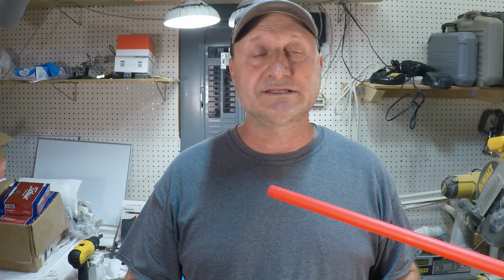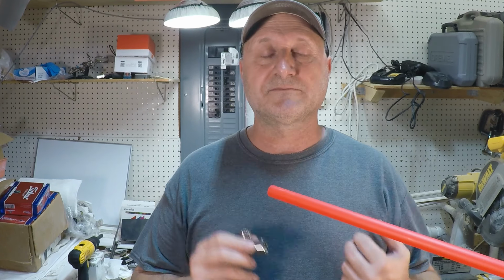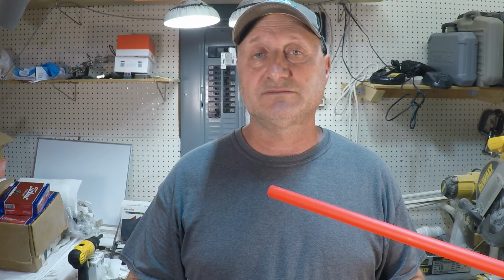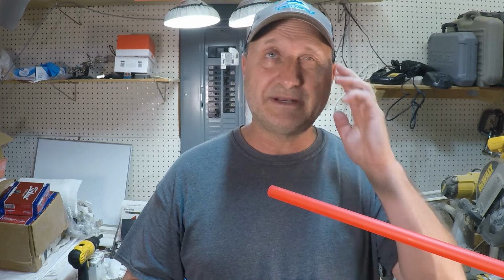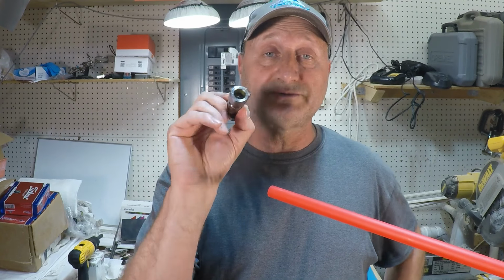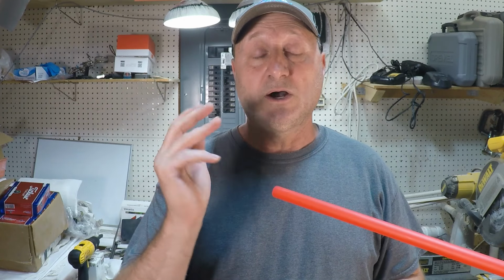And again, it doesn't matter that you installed it properly, but that expansion and contraction without the inner sleeve will create a potential serious and hazardous situation. And water is, in some instances, just as bad as fire. Well, maybe not just as bad. I say fire is worse. Number two is water. And I prefer even the PEX type push-in fittings than I do compression fittings, because if you install PEX properly, it will be fine. So that's the story, and that's why you should pay attention and not buy a compression fitting if you're using it on PEX pipe. I hope this was helpful for you.